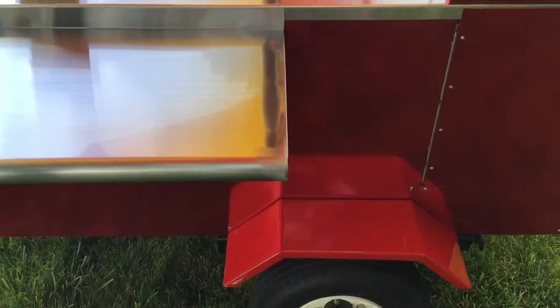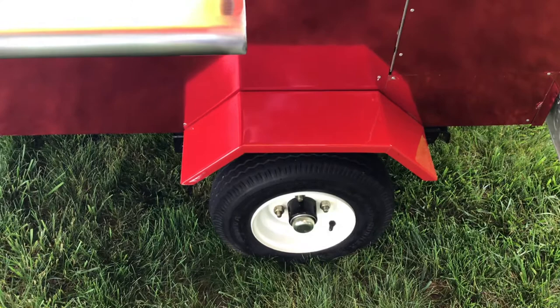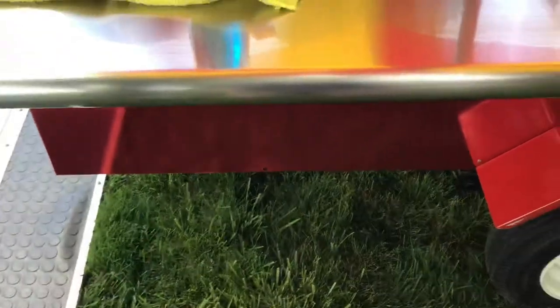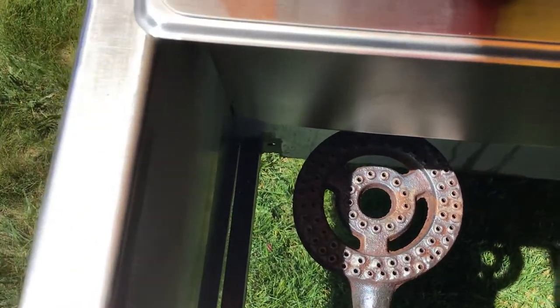Now for things I don't like: even though those are Harbor Freight or Northern Tool trailers made in China, they're not bad - good quality for what they are, nice and lightweight. What I don't like is when they build up the frame underneath extending off the Harbor Freight trailer they don't prime or paint them, so they're gonna rust - especially if the cart was sitting outside like this one was. Also these are Chinese-made burners - they work fine but if they get rust on them it'll affect your burn, so you need to wire brush them out, use a pipe cleaner, blow them out, and you'll get a really good burn.